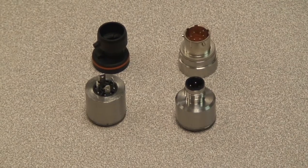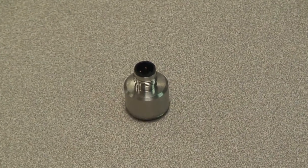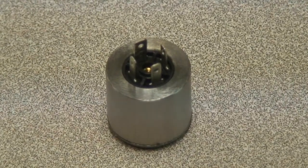We offer a variety of pressure connections. We also have the M12 electrical connector, IP69 rated — an industry first — which is good for harsh environments and outdoor use, or the 9.4 mini-DIN connector as standard.